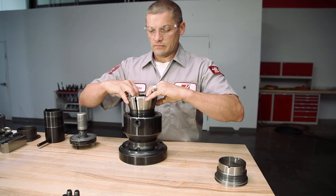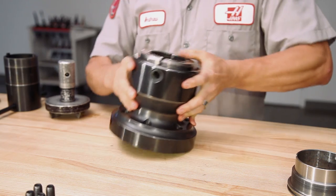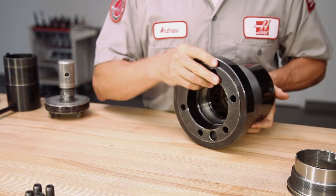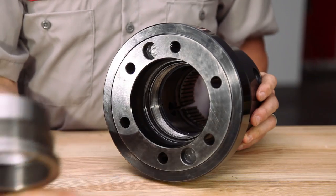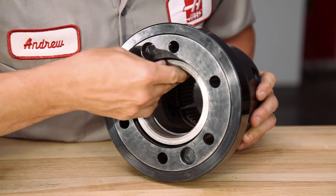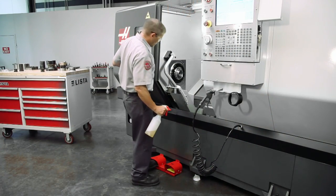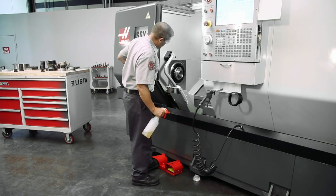Now we will quickly demonstrate how the collet chuck is mounted and then return to installing the three-jaw chuck. Collet chucks grip the workpiece as well or better than the most accurate set of soft jaws. The collet chuck body attaches solidly to the spindle face and the draw nut connects the collet to the draw tube, which compresses the collet in against the chuck body, gripping the workpiece. Andrew starts with the draw tube in the unclamped position and cleans the draw tube threads.